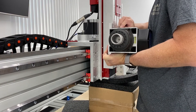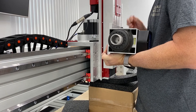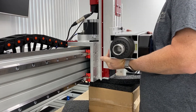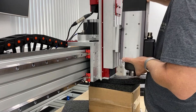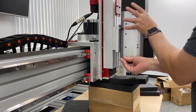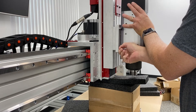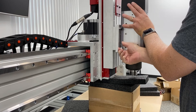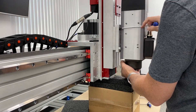The tramming plate is an option. Here you see me taking the spindle — which I would guess weighs about 30 or 40 pounds — and manhandling it to at least get one screw in. I got the upper left side screw in and then was able to go through and do the other screws one by one. It would help if you had a second person with this heavy spindle, but I did manage by myself, so if I can do it, you can do it.